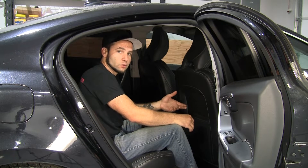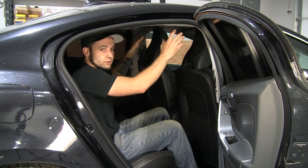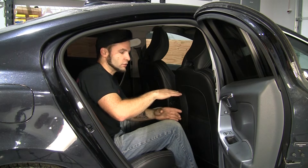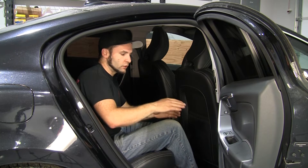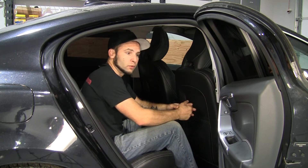The other method is to use boxes. You design basically the same cage, but three inches short, so you've got access to weld it while it's in the vehicle. Then you lift it up to the point it's supposed to be at and build boxes to fill that height. Those boxes are welded securely to the chassis along the sides, bottom, and wherever else you need to — your rule book will define those things.